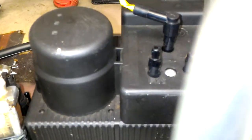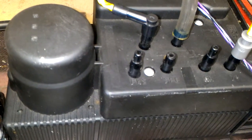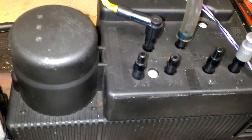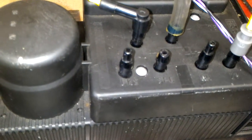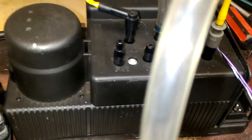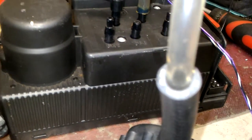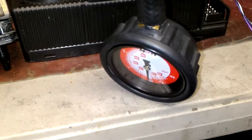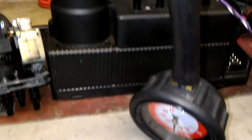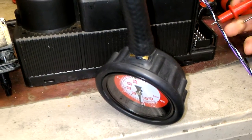We're going to activate — this is the port for the trunk handle. This one is broken but I'll fix it. I'm going to activate the trunk handle and it's going to start hissing. You can see it's blowing air. And then I let go — it's creating vacuum. I did close it now, so the vacuum was created and the pump shut down. We're going to go back to door locks, because before when I would activate door locks, the air would come out of the trunk handle only, and it was very bizarre.